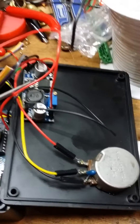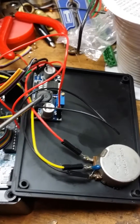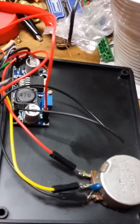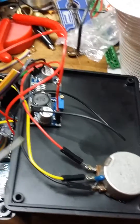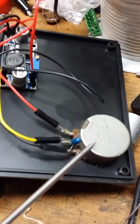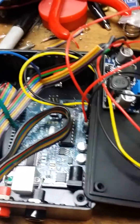One thing I'll show that I didn't have before is this little voltage regulator. I'm firing this from the 12 volts that comes from the 2100 on the red wire, and that's 12 volts, so I run it through this regulator here that is adjustable and I adjusted it down to five volts. That's what I'm using to drive the Arduino in the circuit, and then I went with a potentiometer here, and that's pretty much it.